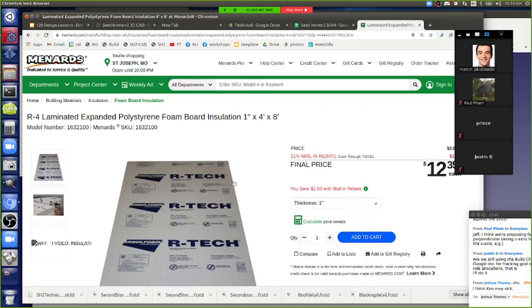You can put one of these on your inside and then do the interior plywood, something like that, or put this, let's see, where would you put that, exterior? Yeah, either interior or exterior, you'd have to add one of these, one inch insulation like this, which is not particularly a large change. You might have to go from 2x6 to, yeah, there's different ways to do it. You either add another layer of this or just frame it out larger, instead of 2x6, 2x8s. Something like that.